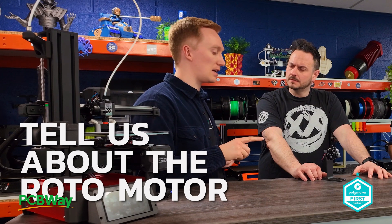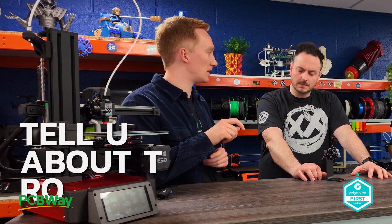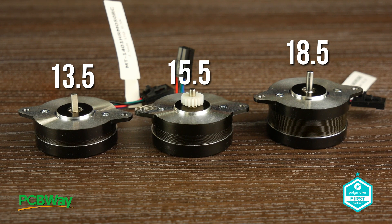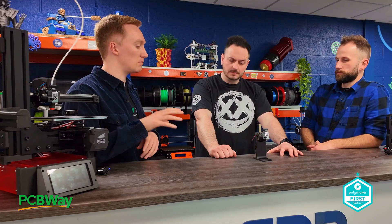This one is actually a 15.5mm long NEMA 14 round motor, which isn't a standard offering — they go from 13.5 to 18.5mm. We looked at the 13.5mm but that really just didn't have enough to get us going with this project. So we were looking at the 18.5mm, but as we were talking about earlier, we just didn't want to carry around that unnecessary bulk. So we worked with a motor manufacturer who developed this motor to this custom sizing specifically for this project.